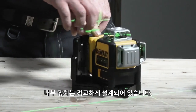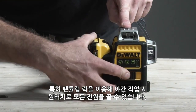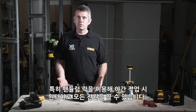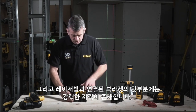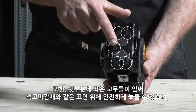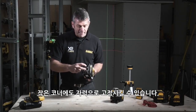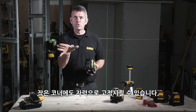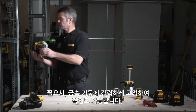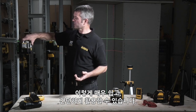The mechanism inside is quite delicate — you have the pendulums. So when you're packing it away at night, the easiest way to switch it all off is with a one-touch button: it's a pendulum lock and it switches absolutely everything off. The unit rotates on a magnetic base. On the back, there are little rubber dimples so you can place it on finished plasterwork, but the magnets are strong enough to attach to a corner bead in the plaster or to metal struts for first-fix work — very flexible.